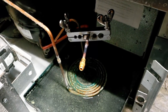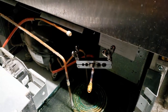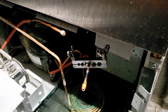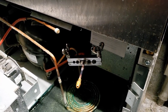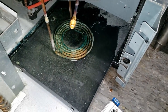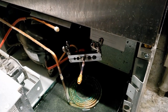We got that done. We'll cool it down, get the valve core in there - chances are this is going to be low. Factory recommends you go on the high side. We're just gonna see if it looks low to begin with, then add a little bit and order a coil if that's where we need to go. We can check with the customer about a full-blown leak search. You can see the coil down below - it looks like crap, but I didn't pick up any leaks on that. Let's go ahead and get tapped onto this thing.